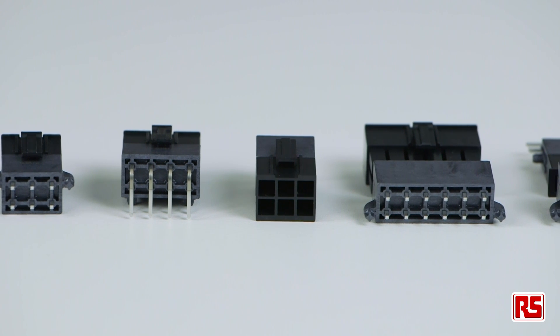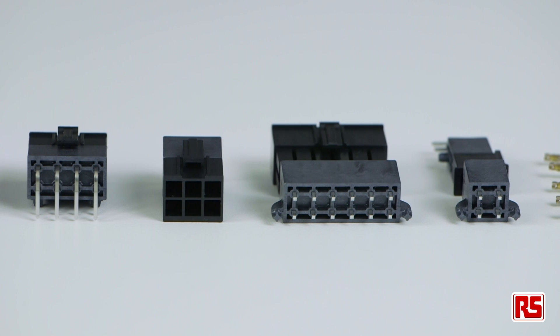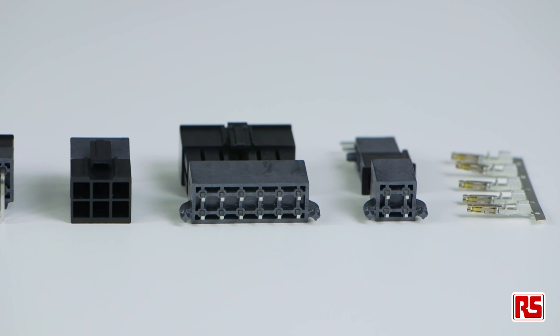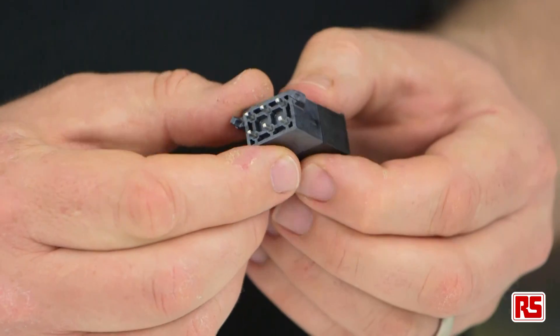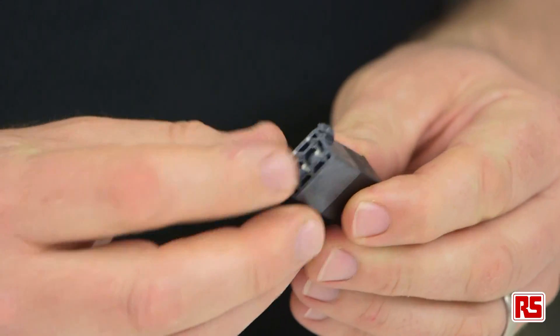The largest member of the family is the MegaFIT, using a pitch of 5.7 millimeters between terminals and capable of up to 23 amps per circuit. Available in the wire-to-board configuration up to 12 circuits, the MegaFIT is ideal for power applications. They are even hot pluggable, allowing safe connection and disconnection under load.